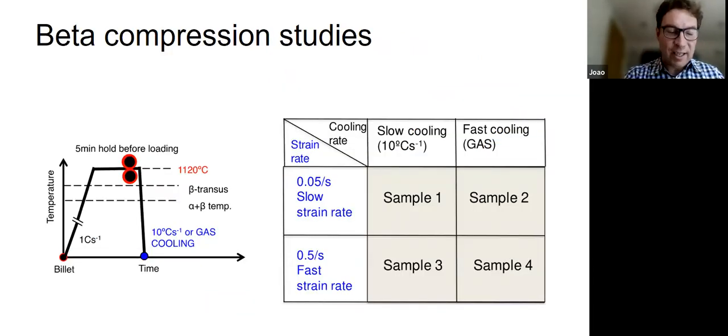So we wanted to make sure of one thing. If you read Leo's papers and so on, on steel, they often show that when you do hot deformation of steel and so on, you do a recrystallization, you often end up with this alignment of the cube component along the compression direction with the rotated cube texture development. And we know that that's a characteristic texture. And there, it seems to be due to recrystallization. And in that experiment, if you do beta rolling, if you do BCC rolling of titanium, you'd expect that the more time you allow for recrystallization to happen, the more of that component you should get and the stronger the texture should be. So we did that.